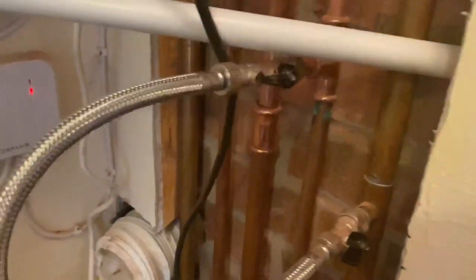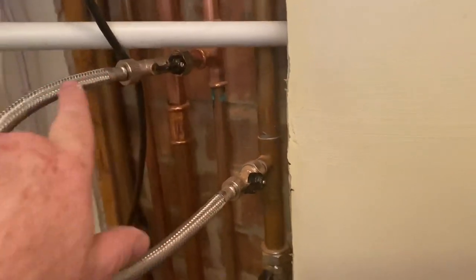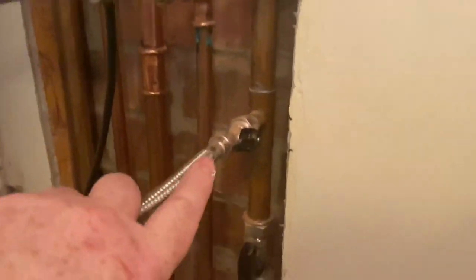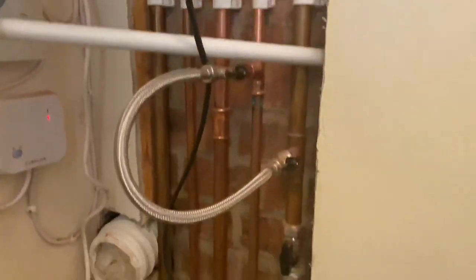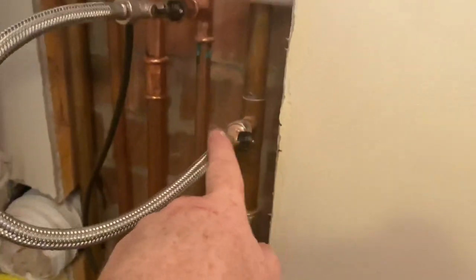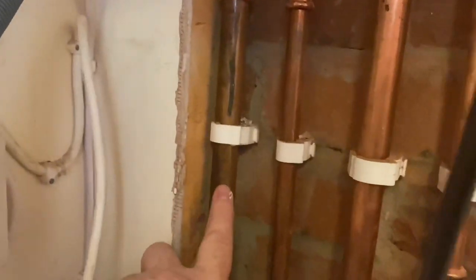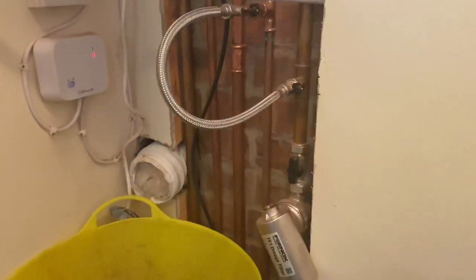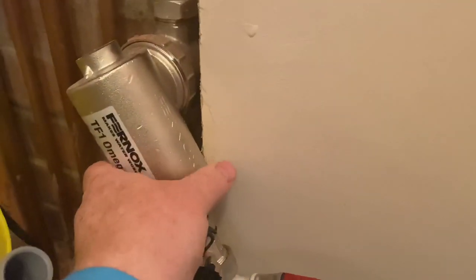Just flushing this now. This is just a mains flush - it's the last flush if you like. We've got these valves fully open, cold water going in, and the boiler is on full so it's in a hot flush now. Cold water goes in, goes back to the boiler, the boiler heats it up, it comes out hot, goes around your system, and comes back out of this valve here. This valve here is warm but the pipes here are cold.